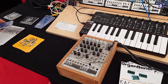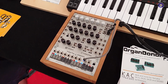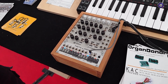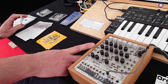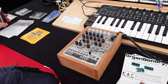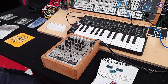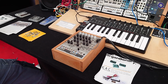And you also have a 606 module? Yeah, we have the 6 mod 6. Which is a TR-606 with original circuitry, but with a lot of mods added. It can always sound like the original 606, but you can go crazy and do a lot to the sound. And there's a sequencer, which can be used with the mod 6, but which can also be used standalone. It's an 8-channel trigger or gate sequencer. Great. With, of course, a lot of functions. Like song mode with various patterns, probability, swing, ratcheting effects, live mute modes, and so on and so on.